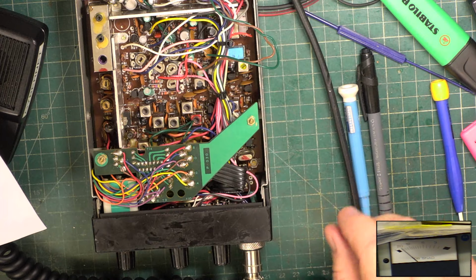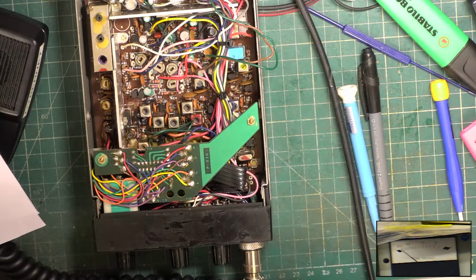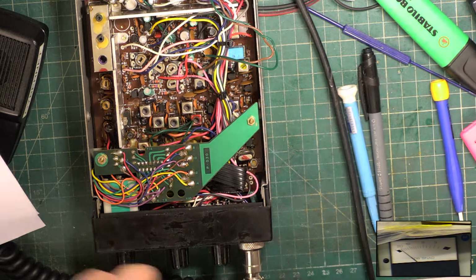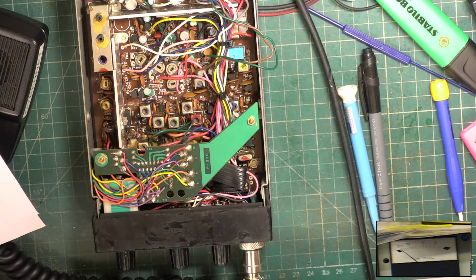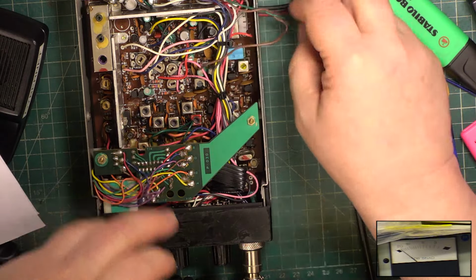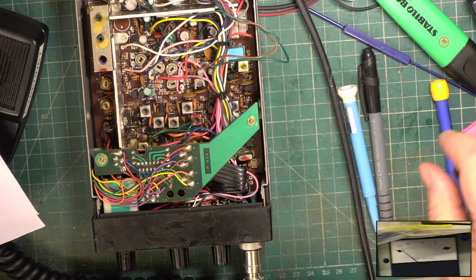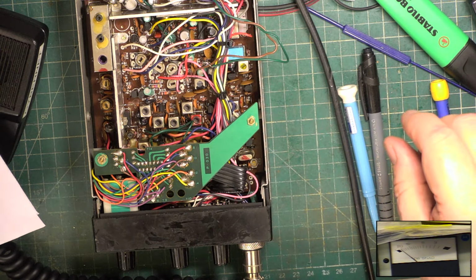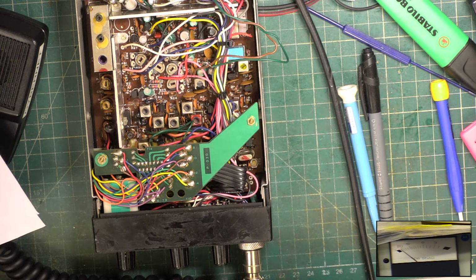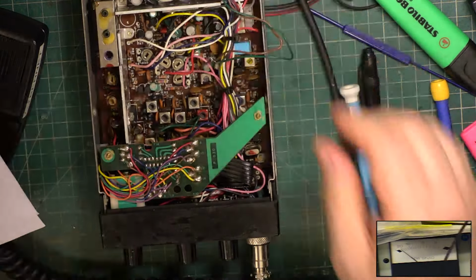Right, let's deal with this squelch. I'll put the speaker back in so that we can hear. It's amazing how just slightly altering the detector makes the set less sensitive, but then it brought it in more sensitive with one of the IFs being out. So it's six of one, half a dozen of the other, but at least it won't be garbled, and that detector was very, very slightly out, and that may have made it slightly distorted on receive.